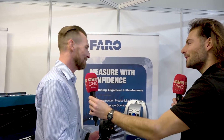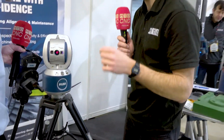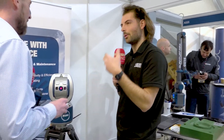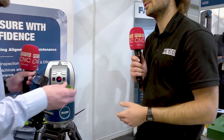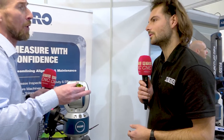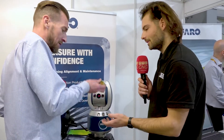Accuracy over about 10 metres is probably around 90 microns, maybe just a tiny little bit less — which is really quite accurate over a long way. We have a lot of customers that use these for aerospace applications. People will be using this to measure wing orientations when they're trying to put wings on, or to align back doors of military planes. How do we know we've got it right in that aperture? It's got to be right, and this is a fundamental way to be getting it right.